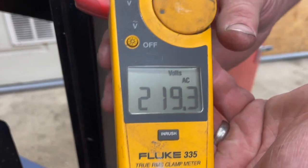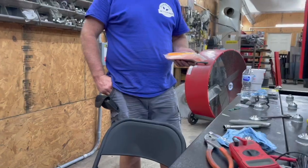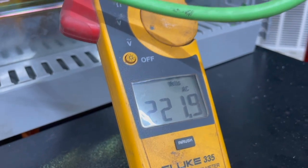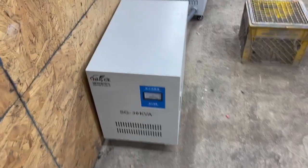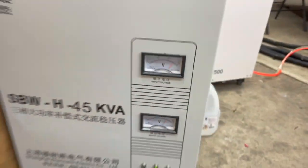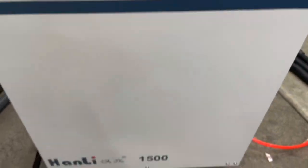Just showing you some of the troubleshooting we were doing, working back and forth with Prima over chat. This is at night. We worked through a lot of that and got it resolved. Moving the chiller onto its own circuit really solved most of our problems. You can take a look at the voltages — we should have somewhere around 400 volts coming out of the unit.